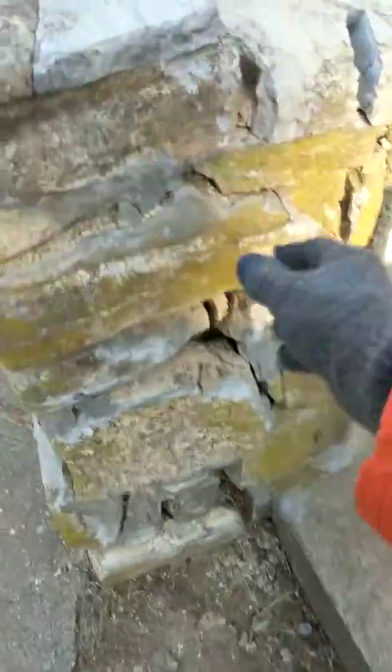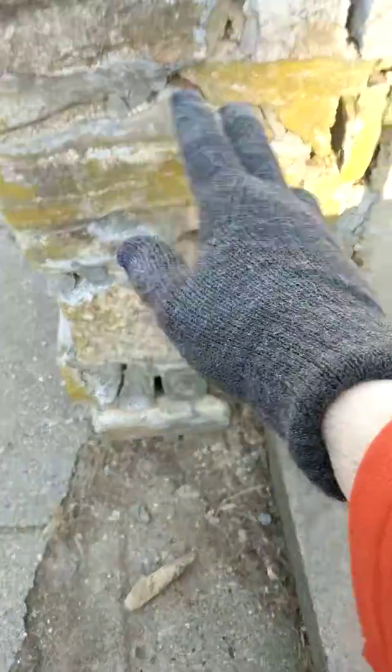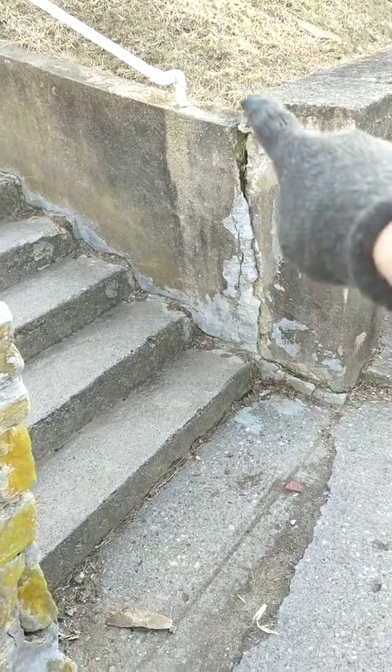But over here on the corners, this side over here, you can see all this brick is loose. This brick is loose. The stuff down here, so we want to refill, take any of the old stuff out, fill it with mortar, get all this stuff fixed up, nice and neat. You want to fill up the cracks in there. We want to fill up anything over there as nice as we can.